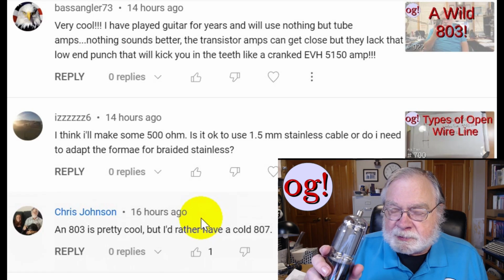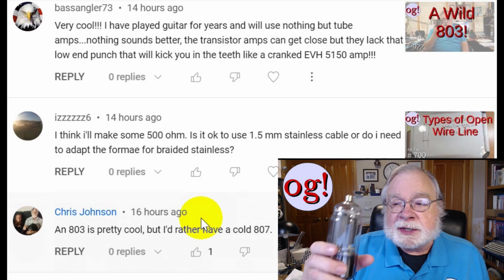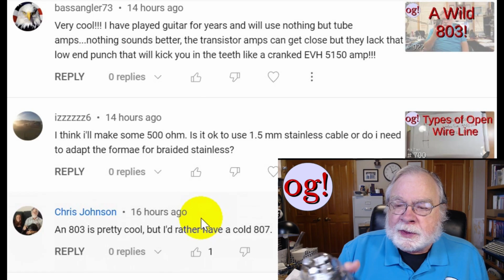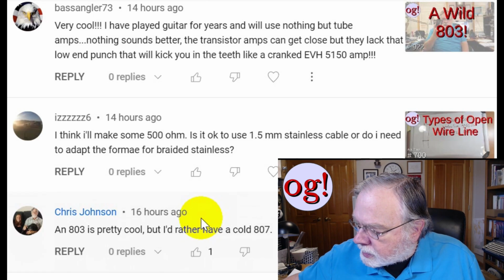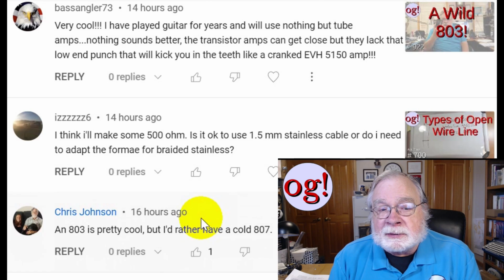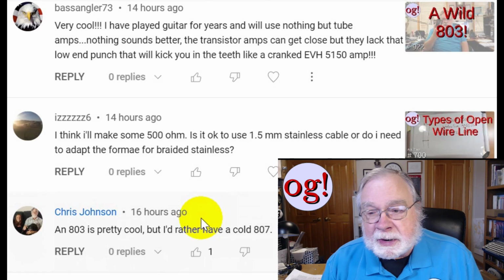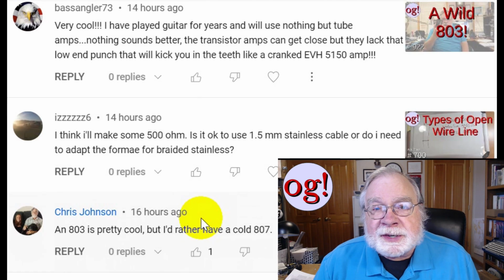The reason they have been dropped is twofold. One, the filament. You've got to keep the filament lit. This filament alone takes 48 watts. 48 watts just to heat this thing up. That 48 watts adds nothing to the power output. The other problem was the high voltage power supply. This is the plate connection here. The high voltage power supplies are dangerous, require large and expensive equipment. And, you know, the AM transmitters of the day were large, heavy, and it took a lot of money to get something that had some serious power output. So on the AM band, the largest power allowed on clear channel stations is 50,000 watts.